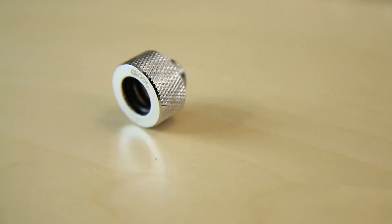Rigid fittings are a pretty big deal because unlike soft tubing where you have the tubing being clamped down on a barb with teeth to grab onto, rigid tubing is something that's always been a little bit scary to people because the only thing holding it in is an O-ring. That O-ring is not a very high friction piece, so things like jostling, shipping, or moving it around always freaked people out because it could just pop right out. Now, fast-forwarding several years as hard line fittings started to become more popular, just about everybody has some sort of a compression fitting.